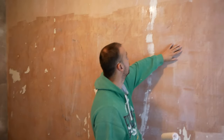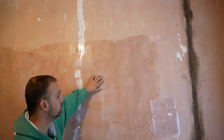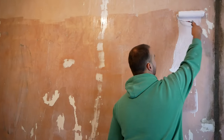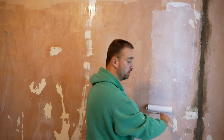I've already started the PVA in here, and we're going to have a little bit of scrim tape along this crack. It's hard to say what ratio of the mixture PVA is — this wall is actually pure bare, so there's going to be a wee bit of suction with it. But if I need to give it another tight coat, I will.